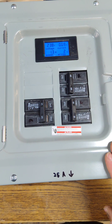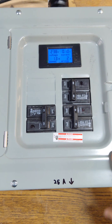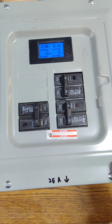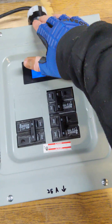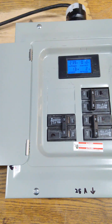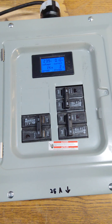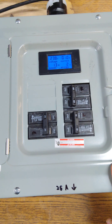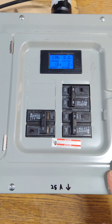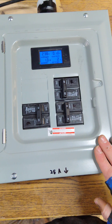Three-wire boxes are $350 as long as component costs don't go up much higher. If you want the box with L6-20 outlets, it will still have the L6-30 coming in. Four-wire setups with 110-volt output go up a bit in price. I also usually put a USB outlet on those — guys really like being able to charge their phone when they're not running equipment. So $350 for the three-wire setup.